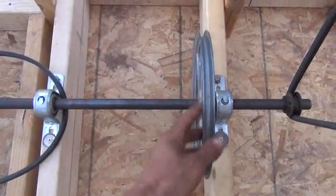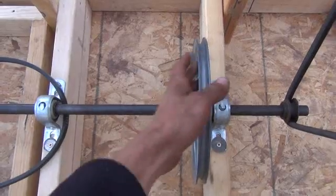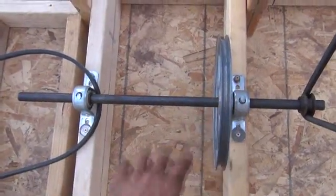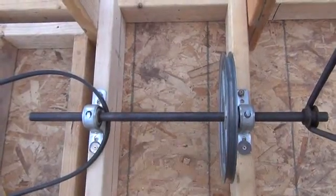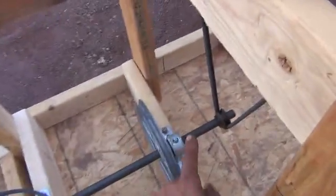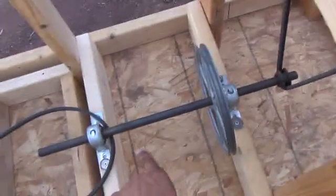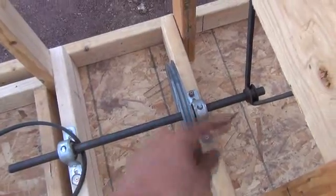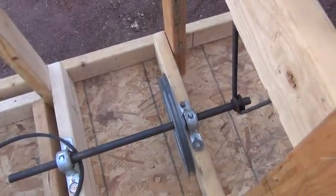It comes down here to one 10-inch pulley. These are aluminum pulleys from swamp coolers — you can find them at any hardware store. I've got another pulley still to put on there. We've got a one-inch pulley on the end as our drive pulley to the lower shaft, and these two will actually spin our discs. We'll have one belt looped opposite and one belt running normal, and that'll give us a dual directional spin on our discs.